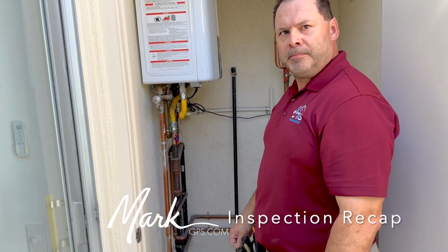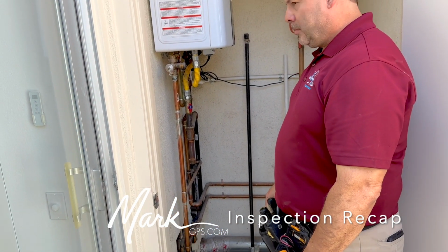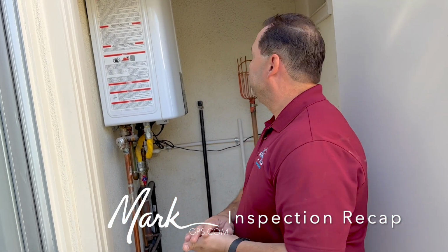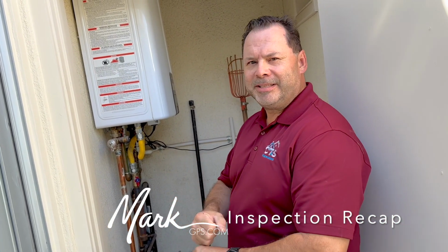On these, backing up a little bit, you were saying that these pipes down here should be insulated, and that's because they have hot water in them? It's just code requires all water heaters, the first 5 feet of water pipes coming to and from the water heater required to be insulated. Okay, so that's like going to the hardware store and getting those little foam things. Yeah, the black foam insulation, like wrapping around our handlebars on our bike back in the day. They're cut lengthwise and wrapped around it. Yeah.